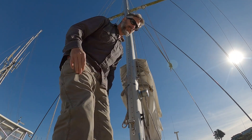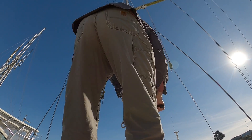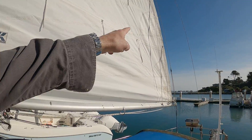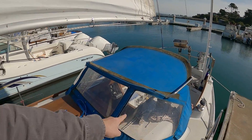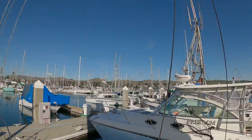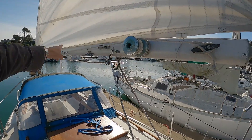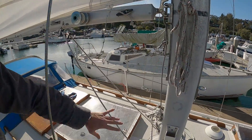There's a bit of wind in the marina today, I'm just going to give it a whirl and see what happens. The reefing lines are a little tight, which is preventing me from going the last little inch all the way up. There's the issue — the reefing lines come down, go on the boom, and currently I have them going down to the deck and then back to the cockpit. The idea is to not go back to the cockpit, just come to this other side where there already is a winch, go straight from here to there — just have a bag or something for the excess of the two reefing lines, keep them all up front, and get rid of everything back on the deck.